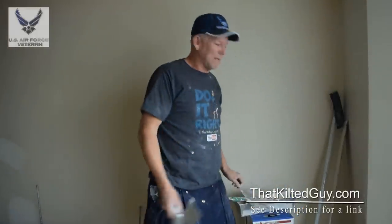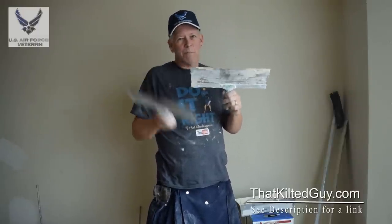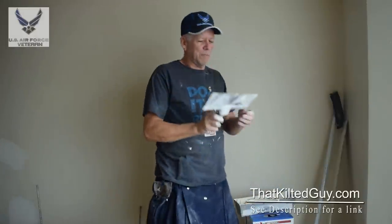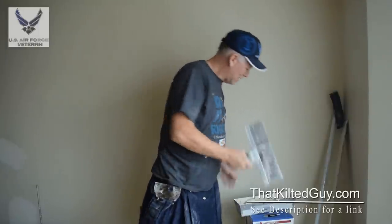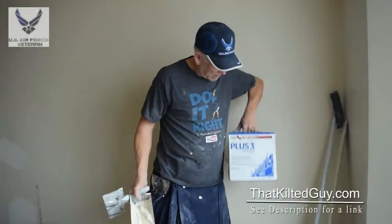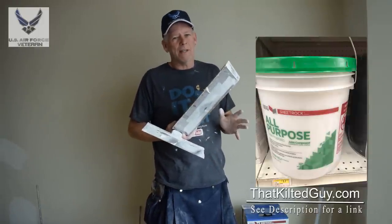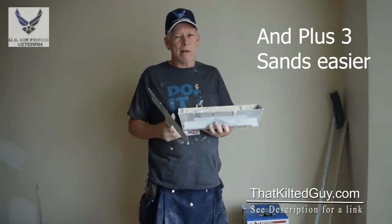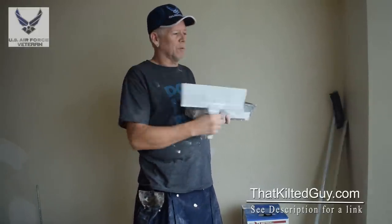What do you need to do this? Obviously you need some drywall mud, pans, and knives. I often use a 14 inch knife because it gets more done quicker. You could use a 12 — the lowest I would go would be a 10, because these float better and you've got less lines that you're going to leave behind. What we're using today is USG Plus Three Lightweight — it's about 30 to 35 pounds but lighter than regular. You don't need the green label all-purpose; this will do everything you need, especially for skim coating. It sands easier, shrinks less, and it's easier to work with.